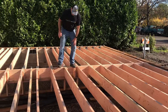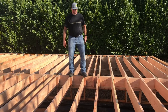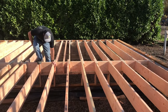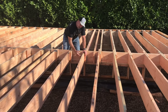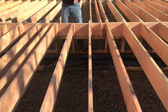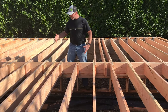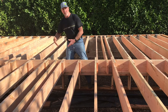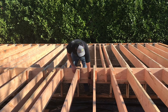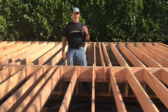The little cripple studs underneath there, the studs in that short wall, are lined up with the joists. Technically I could have used one top plate on this wall, but there are two top plates. When you have two top plates, it allows you to bear a roof rafter or floor joist anywhere you want. I have a couple extra joists falling in weird places, so I went ahead and put two plates on. If your bearing is directly over a stud, those are opportunities to only use one plate — and that would be an example of sustainable building.